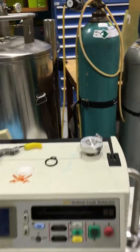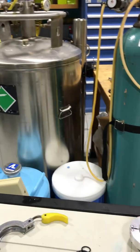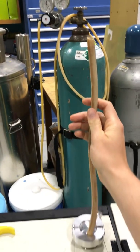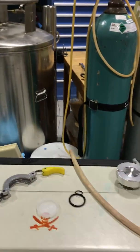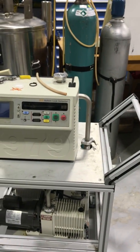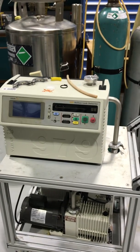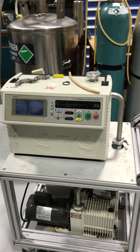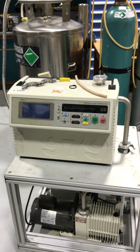And you would spray a little bit of helium, like if that tube thing that I make is just connected, pretend that's my little tail thing. If it was connected here, then you would spray it just a little bit with helium, and if helium can get through the material, it detects if there's helium present. And you want to have a low leak rate, because you want the materials to be not permeable whatsoever to it, because that's what the whole idea is. You want a good seal.